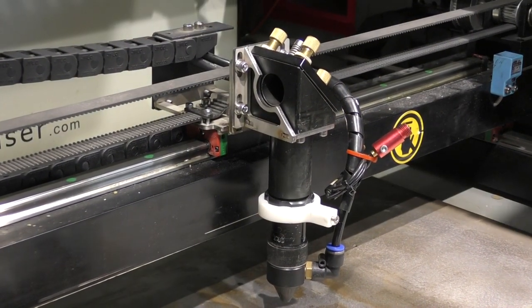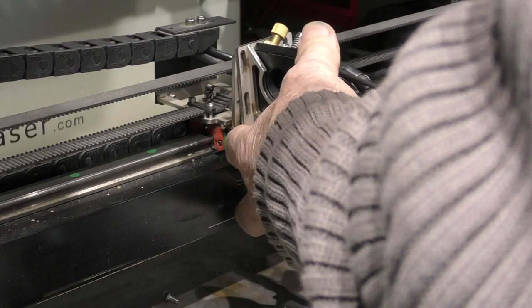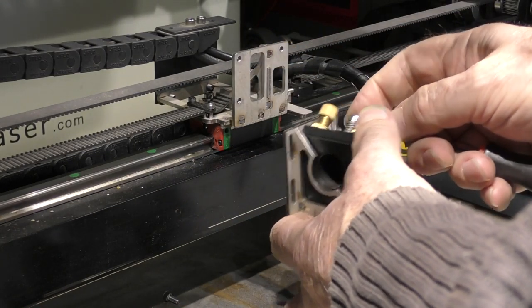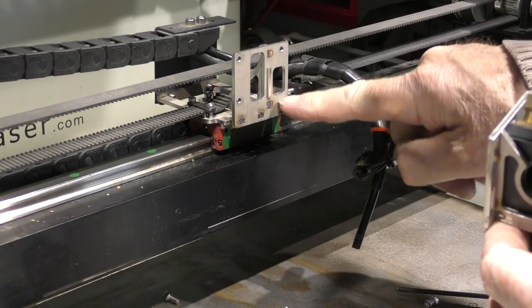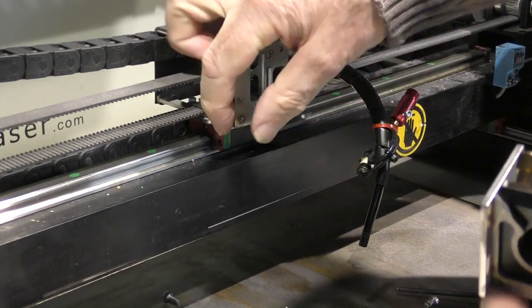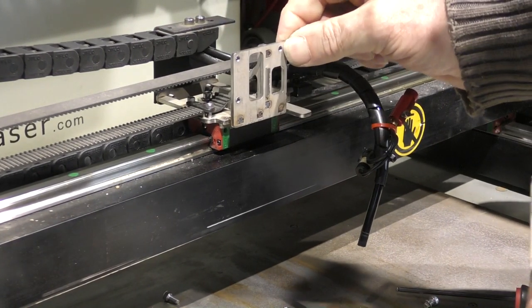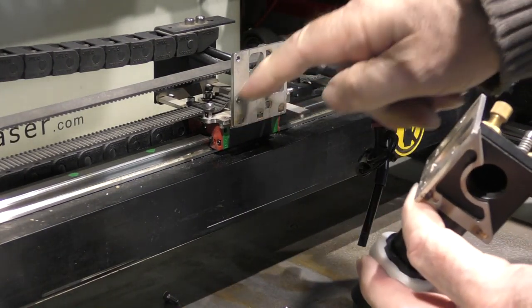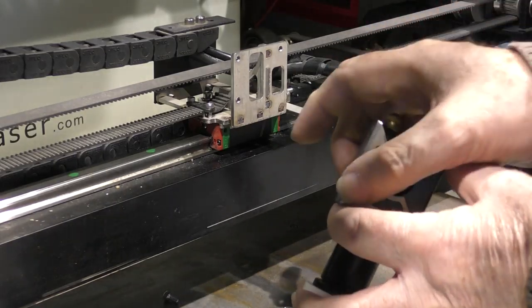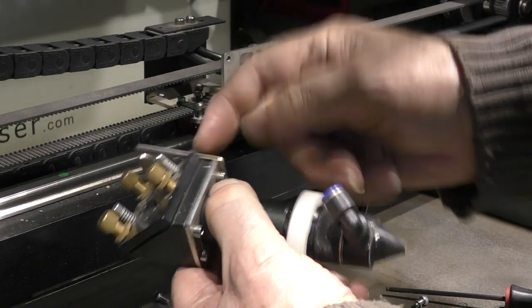Now, this bit here frightens the hell out of some people. Taking the machine to pieces. I just spent ages setting the head up. Now, unfortunately, the mounting on this head is not as good as it could be because we really could do with a fixing point here, right close to where this whole thing is nice and stiff. Tucked up this corner here, there's a certain amount of flex on both here and here. So that's why this is relatively stiff and heavy, because I couldn't get behind here with a screw.